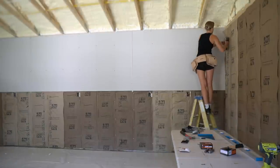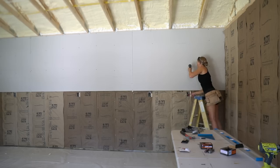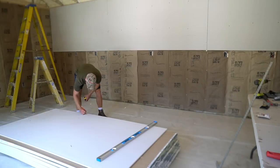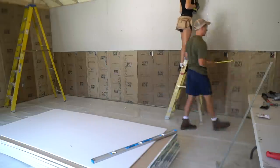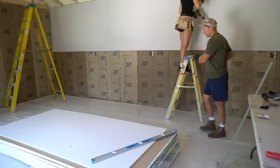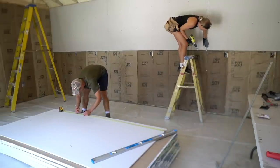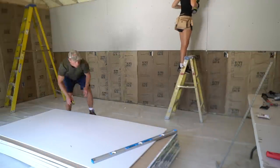The joint of the drywall along the length of the stud is called a butt joint. For cutting out around outlets, switches, doors, windows, fixtures, we used a drywall jab saw. If you have a lot of cuts, you may want to consider a rotary cutout tool. Cut the drywall to fit around electrical boxes and fixtures, plumbing rough-ins, etc.